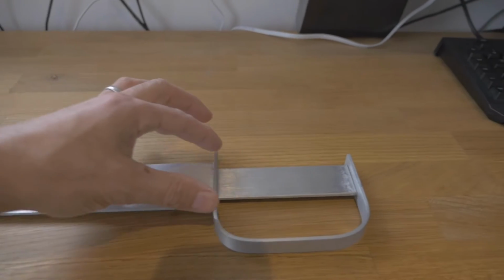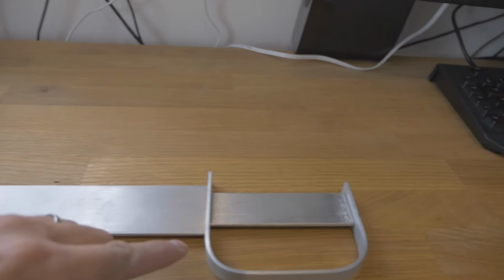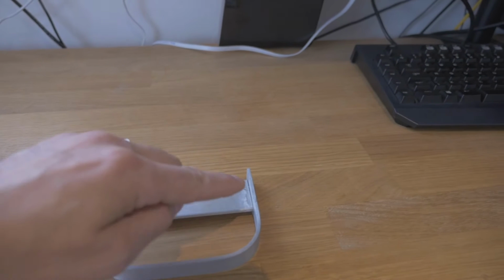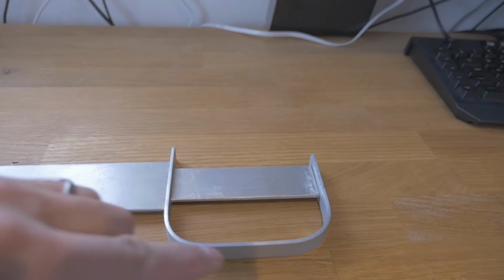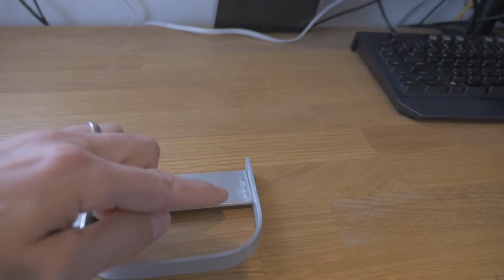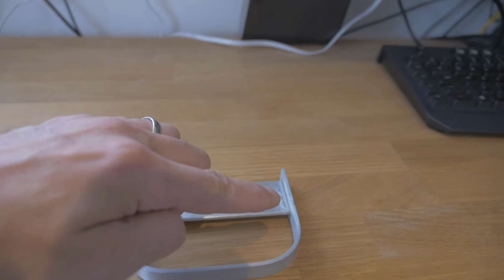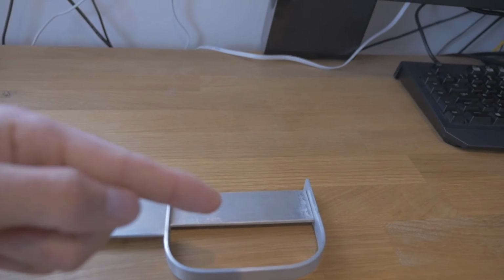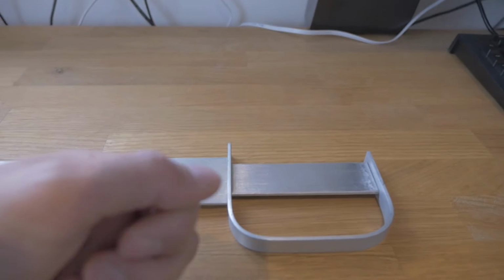I was going to use a single piece of steel for this piece here. I was going to angle grind it out, angle grind these parts in here. And then I was going to get a second piece of steel for this curve, and heat it up on the old forge and then use the anvil to make these corners. Cut a slit into the end here, slide this on, and then somehow connect the steel together here. I can either MIG weld it, because I've got my MIG welder, or I could epoxy glue it onto here or something similar. And then on these handles, I'm thinking of using that tape that you get for tennis rackets and rackets like that.